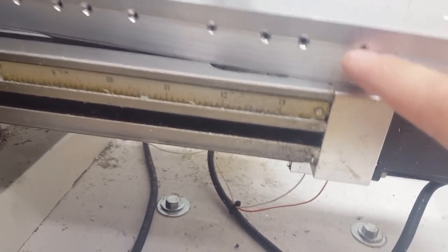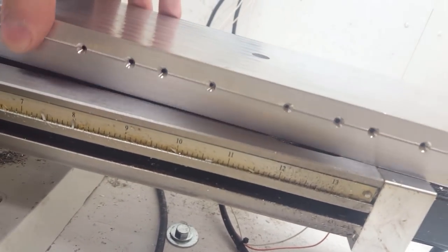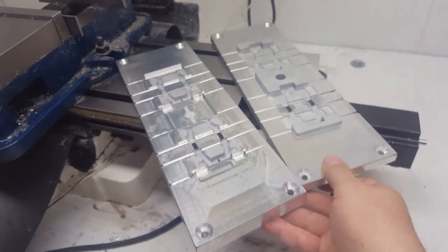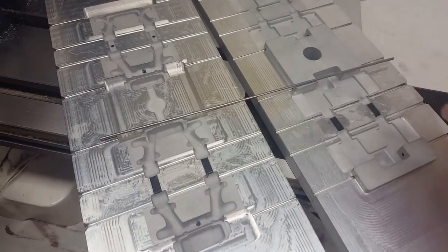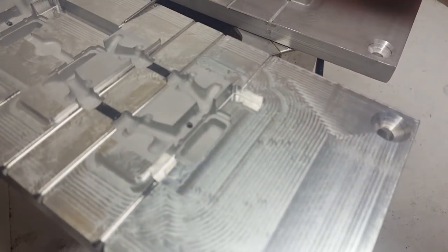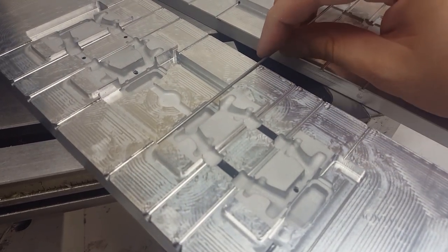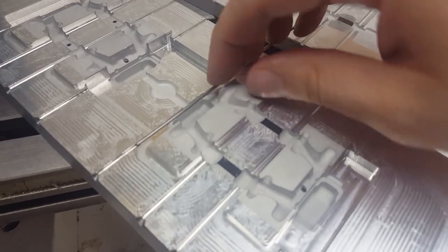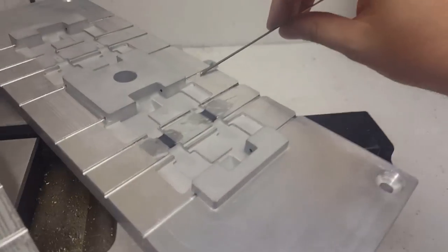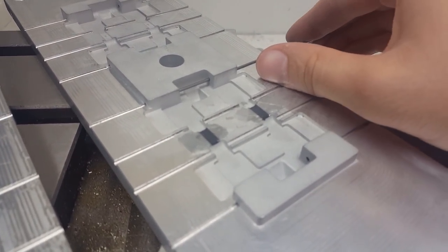And then you can see here, these are the holes where those pins have to go in to actually create the holes in the tracks. And here you can see the main issue I had to overcome. This pin here to make the hole in the track, you can see it's raised up off the surface because the track's in between there. So that's why I came up with the idea to drill a hole sideways through here.